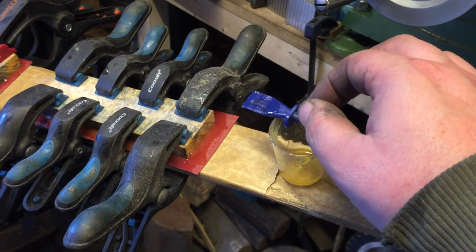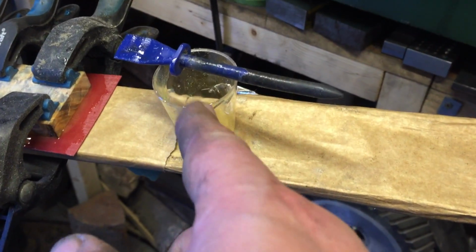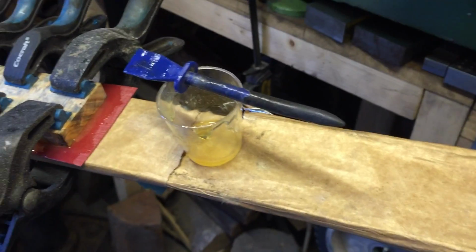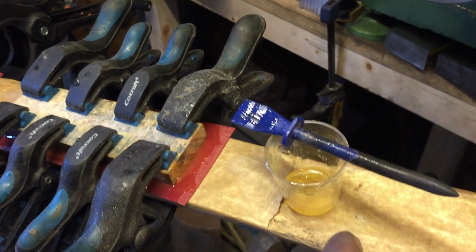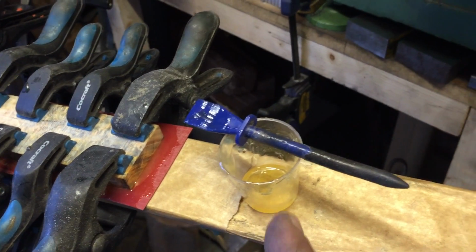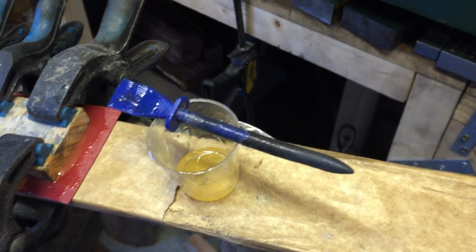It always stays next to the scales, and then in the morning the first thing I'll do is I'll come in and stick my finger in there and check that epoxy, and if that's rock hard and set in there, that's rock hard and set on them. It always gives you an indication. The ones I come in and it was a little bit soft, I ripped it all off and started again. I had to grind back the scales, but if you're not concentrating, or you put too much of the one in than the other, that's a great indication next day to let you know. If I hadn't have done that, I wouldn't know.